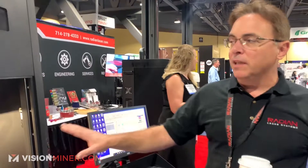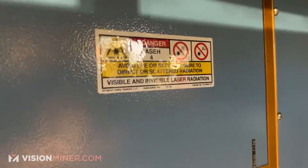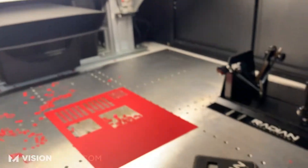Can it do like a Lexan polycarbonate, stuff like that? How quickly can it go? The Galvo lasers will cut just like a flatbed laser. The problem with the Galvo laser is they're really marking machines, because when they're cutting, everything is at angles. The Galvo-based system uses a high-speed galvanometer scanner — perfect for marking, super high-speed marking. It will also cut, but when it cuts, it cuts at angles.